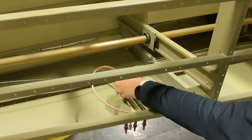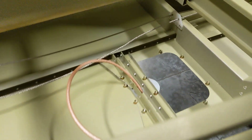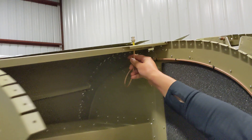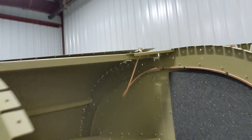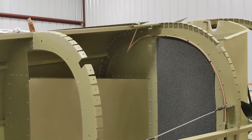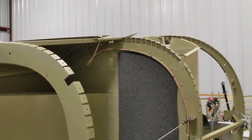Next antenna: we have the COM2 antenna here on a custom bracket. It sits in the inspection hatch right here, and then the inspection hatch goes over all that. Then we have COM1 up here with the off-the-shelf bracket that TAP supplies. One thing to remember is to secure the wire whenever you take the antenna off, so it doesn't pop inside the fuselage — otherwise it'd be pretty hard to get out.